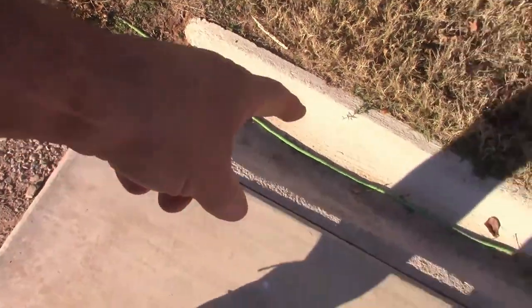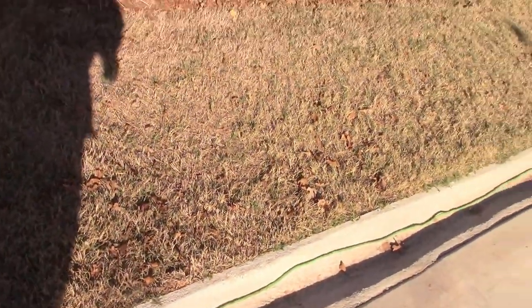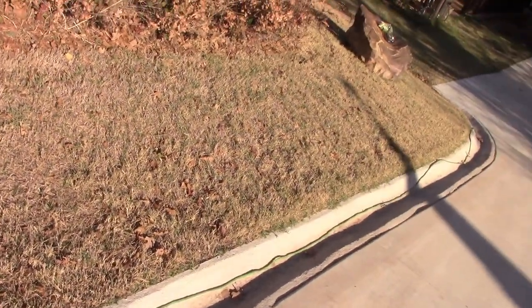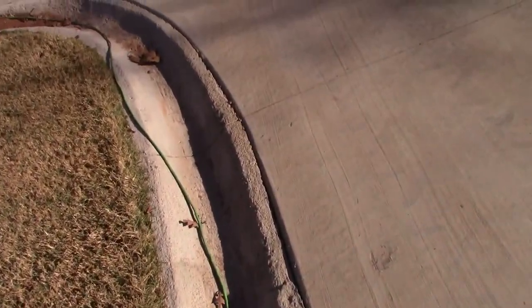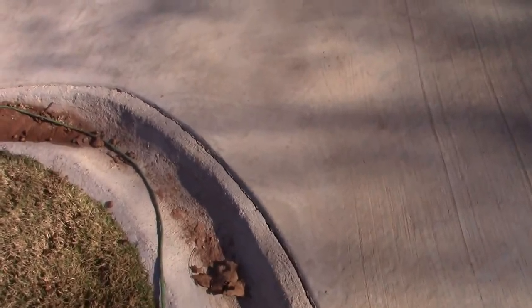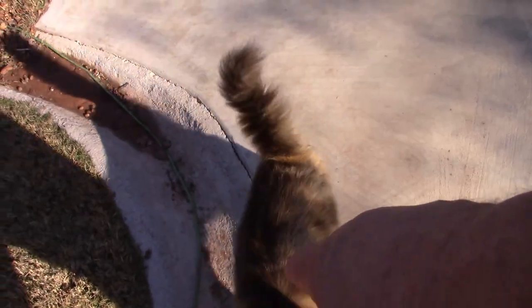To keep it where I can control it, I built this about two years ago. What I'm going to do now — and this is normal because it does happen — can you see the crack right here? I've got to clean that crack up a little bit with a grinder, just touch it up and go all the way down. Concrete shrinks, and see how big that crack is — I've got to clean that up.